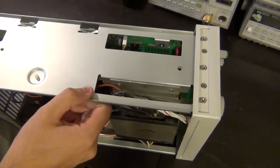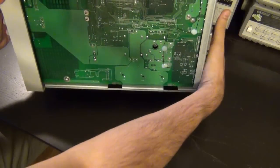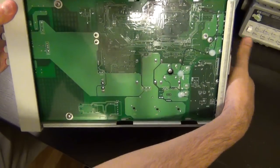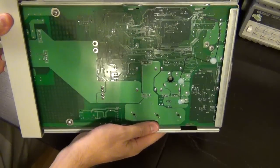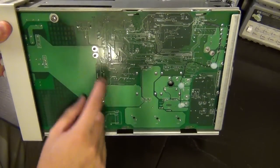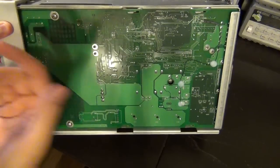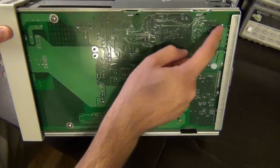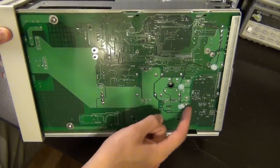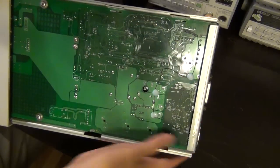At the back of the unit, we have an exposed PCB with pretty much no components on it — all the components are on the other side. You can see some nice features: power and ground planes, thick traces connected to the output, and a mesh pattern in the inner PCB layers. You can also see there's a correction wire going around, so they've made a board fix — it must be an older model where they haven't reflected that correction into the PCB.